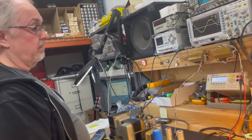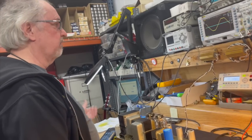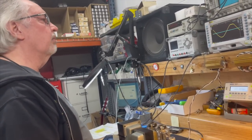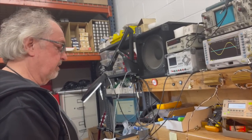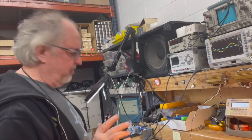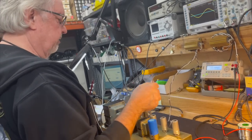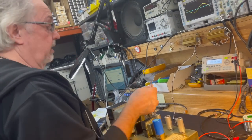And what that really means is there's more filter capacity than is really needed for this amp operating under these conditions. With EL34s in it, which actually have more gain than KT88s, they would pull a little bit more current out of the supply and you would start to see a tiny bit of ripple, but we're not seeing any. So that's like the third confirmation that there isn't anything indicating the need to replace these filter capacitors from 19, what did we say, 93? Yes, 98. 98, even better.